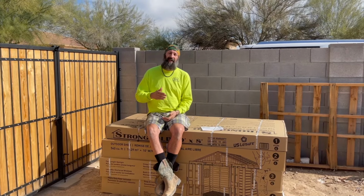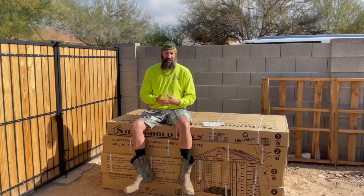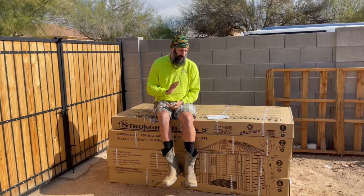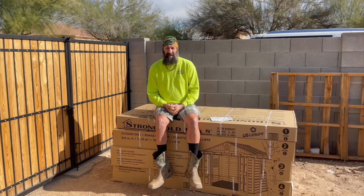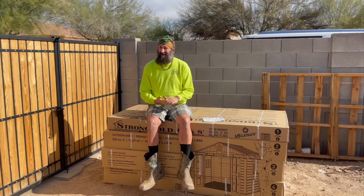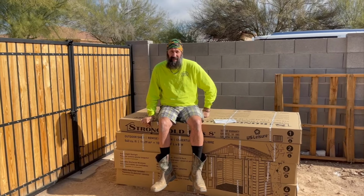We are only putting in this shed blow up toys, cushions, maybe a chair or two. We're putting nothing heavy in here. So we are not gonna go with the 3/4 inch plywood. We are gonna go with 1/2 inch plywood. And we're also dumbing it down a little bit. We're going to 2x4 instead of 2x6. Also for the same reason, we're just not having a lot of weight and it just does not seem necessary.